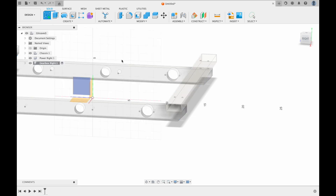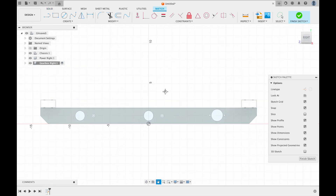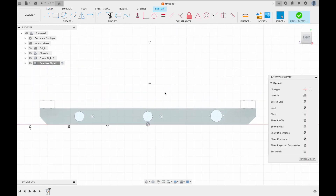Create a sketch while this component is still activated on this face. To begin a gearbox, you want to start with a gearbox planning sketch that you will later use to extrude the plate. You need to first figure out the actual ratio that you're using, because that's going to affect the placement of the holes.